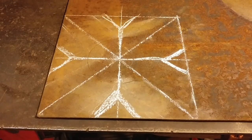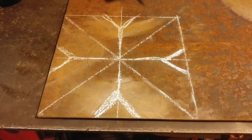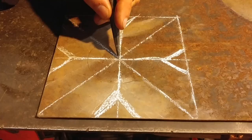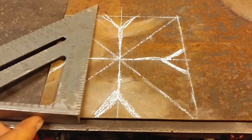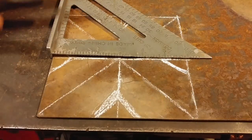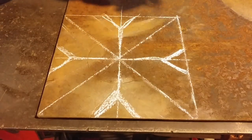What you can see here that I've already laid out is essentially what I'm looking for: a four-petal shade for the lamp. I'm going to forge some seams in it and try to give it a little bit of dimension and character. The way I found center is first I figured out that I needed a six-inch square, and that's what this is. I drew diagonals from corner to corner to give me my center point, then I brought up my speed square and went from left to right and front to back. I did this all in soapstone so you could see it — otherwise I would have used a scribe.